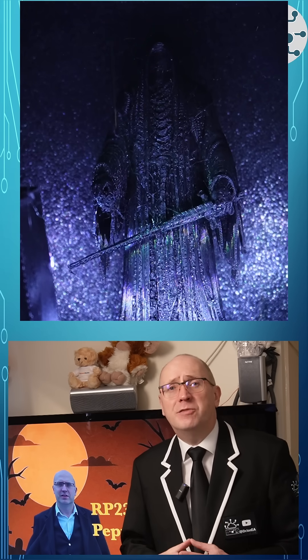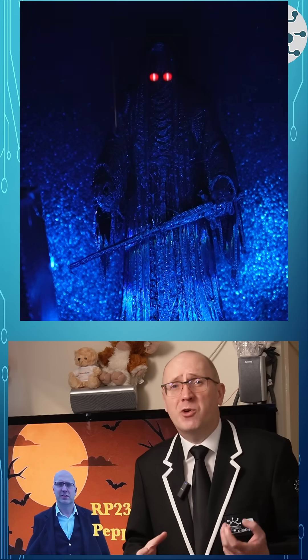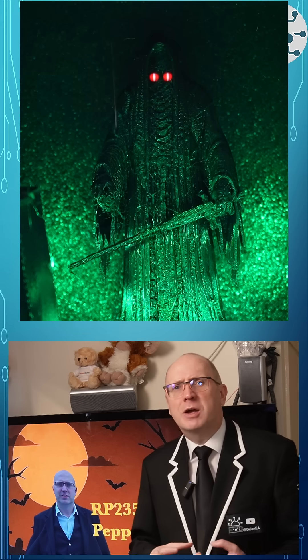The code for this is a fairly simple LVGL application, with some LED driver code as well. I've moved between three scenes: no image, glowing eyes and a ghost head. Each transition involves a phasing of the LEDs to give some interest.